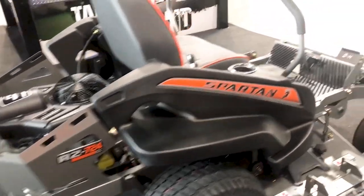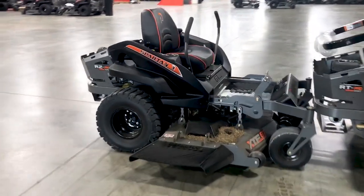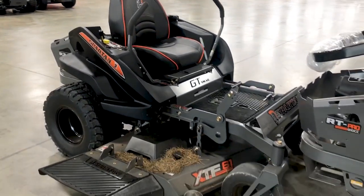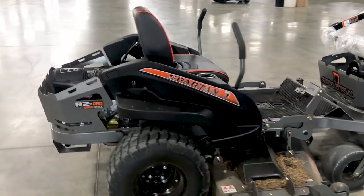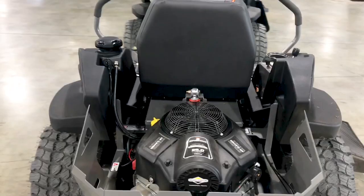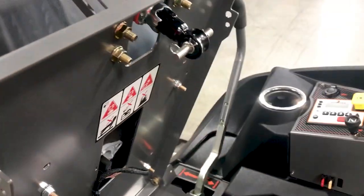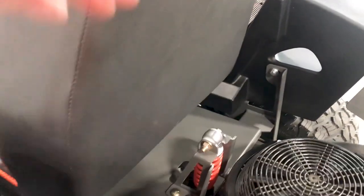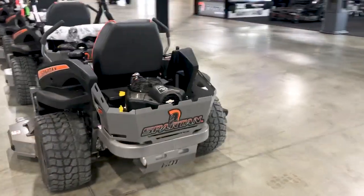Now going from the RZ series, I'm going to show you a dirty RZ Pro series that we used at a ride and drive event. The RZ Pro series has even larger hydraulics — the 450 series hydraulics. You're going to get 22-inch rear radial tires. You can get it in a 54 or 61-inch cut, Briggs & Stratton or Kawasaki engine. Another big improvement is the shock that goes underneath the seat. It's adjustable with three different notches so you can adjust the weight on it. It makes a big difference in the ride with the rear radial tires and that shock — I honestly was blown away.